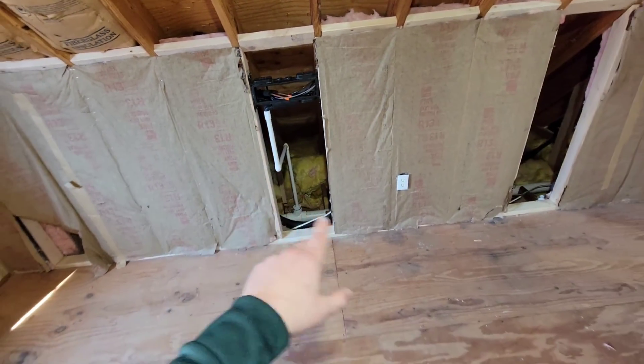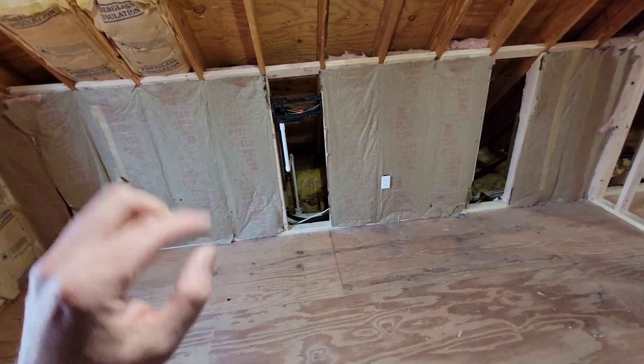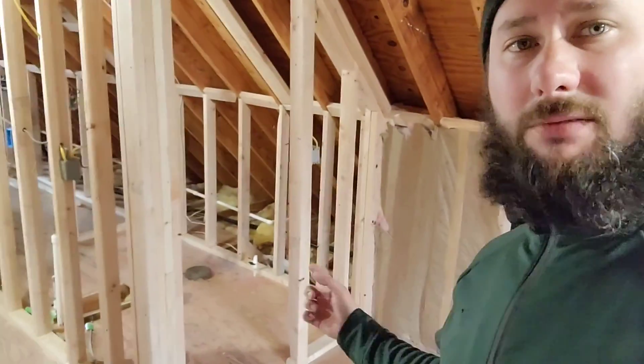One other thing about the bathroom: you do not have to put a unit in the bathroom as long as there's a door leading from the bedroom to the bathroom. You can undercut the door two inches. You've got a bath fan, so between the indoor wall mount air handler's fan running almost all the time — especially during cooling — you've got positive pressure in the room, and then when you turn the bath fan on, the negative pressure in the bathroom pulls the air right in there.